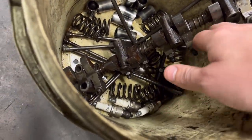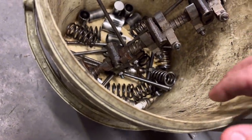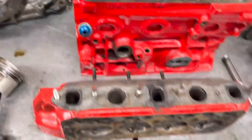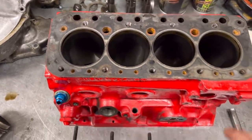As long as the bushes and rockers are a nice slide fit on the new shaft, we're not going to renew them, but we'll clean them all up and face them. We'll clean them up, put them on the new shaft, and that'll be like new really.